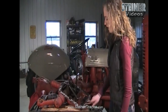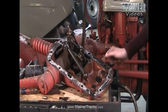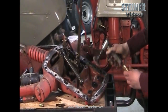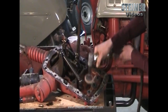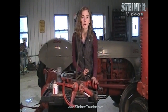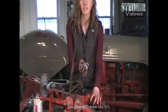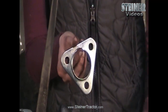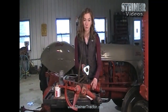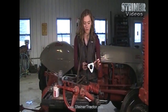Next, let's talk about the gaskets. This is the head gasket for the piston — we'll want to take that off completely and get the surface very clean so we can get a good seal. I also want to talk about the spring on the end. If your spring is sloppy at all — if it moves around — you'll want to replace this part, called the spring seat support. It's a sheet metal piece that controls the hydraulics in this spring and holds the tension. If yours is sloppy, remove it from this end and replace that portion of your top lid.